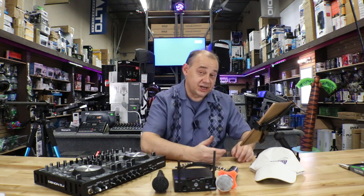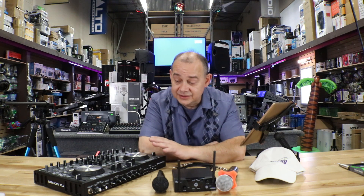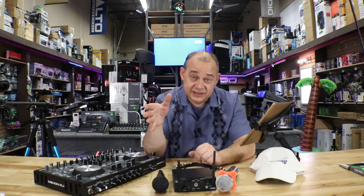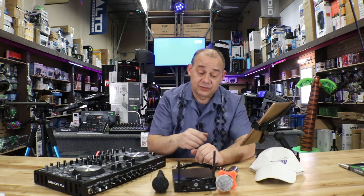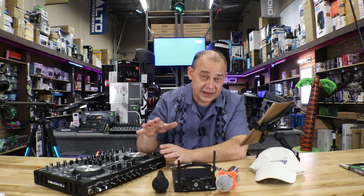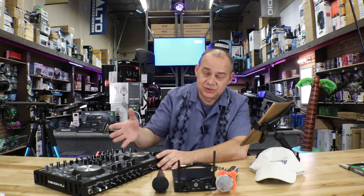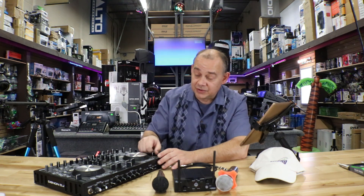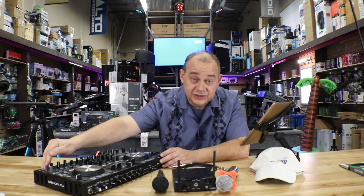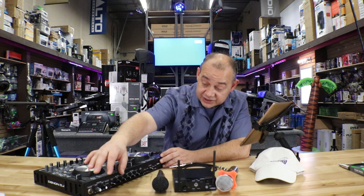From Eddie the DJ, asking about wireless microphone setup for best results. One problem with wireless or wired mics is that if you're on stage with a subwoofer next to you, you can get feedback. Regardless of corded or cordless, that can be an issue. You should always be driving your master volume to full length anyway, pull back on the music, and bring up your master volume to the desired microphone level. Try to balance your system so you can set your mic levels consistently.